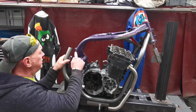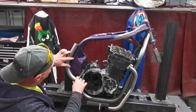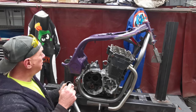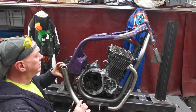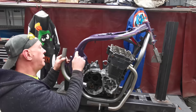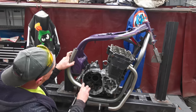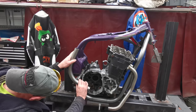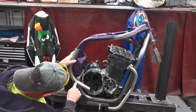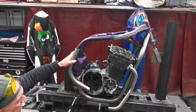What we'll do is we'll have this off here, so I've got as much straight as I can. We'll have a straight bit below it as well. That way I can turn some of it down to fit in here. I'll hollow it out as well, just to help with penetration. And then that'll get bossed in one end, shoved up in there with a gap in the middle. And I'll cross drill that one and that one as well, because then I can do a plug weld, just to make sure nothing's going anywhere. It can come down like that, and then we'll cope it into this bit so it marries up with that boss.